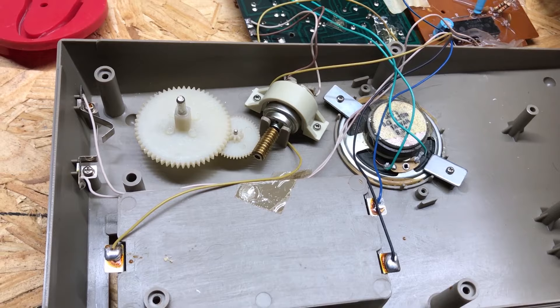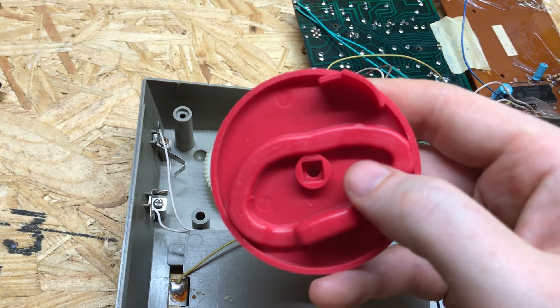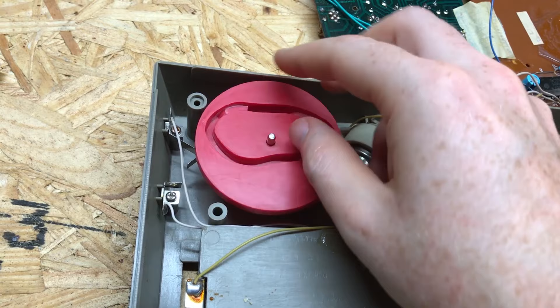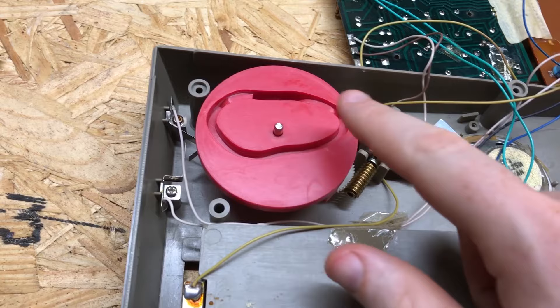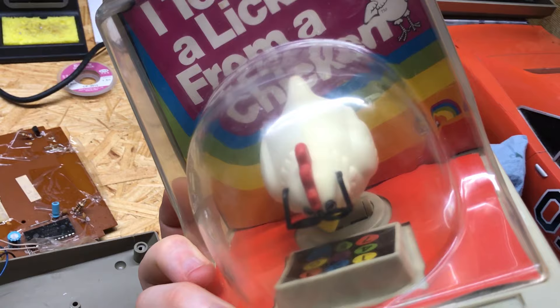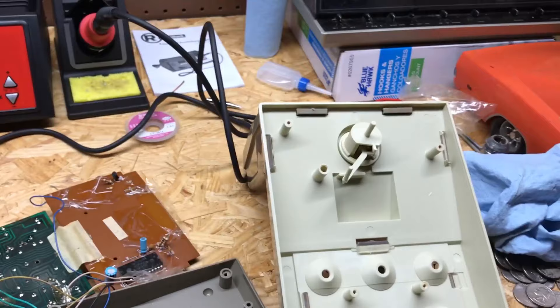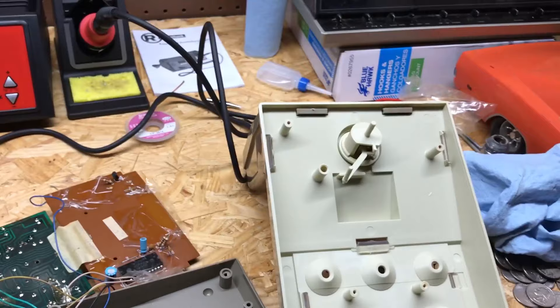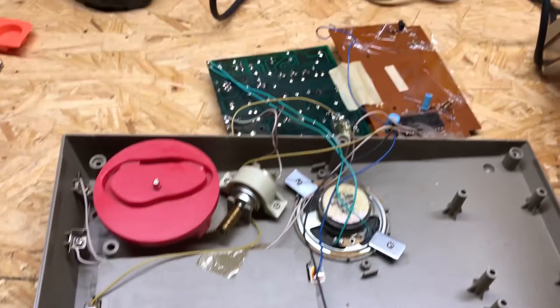That spindle there is used to retain the chicken in place as it's being actuated by the cam. When the cam sits here, that little square thing locks it in place, and as it goes around this sits in there and follows that cam — going up and down — causing the little chicken to bounce up and down and move back and forth. That's how all that works. It's interesting to see how they worked out these little mechanisms — it's simple in one way, and yet at the same time probably overly complicated. I'm sure today if someone wanted to manufacture something like this it would be an even simpler mechanism.